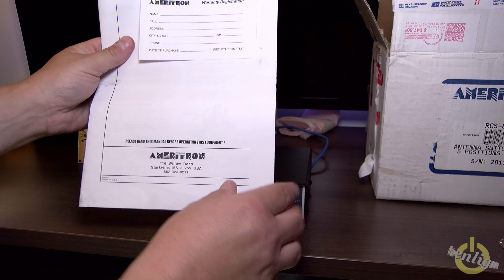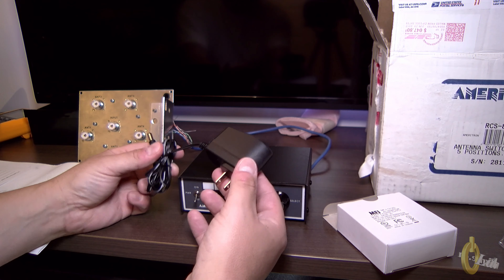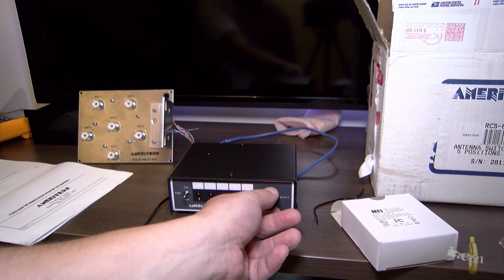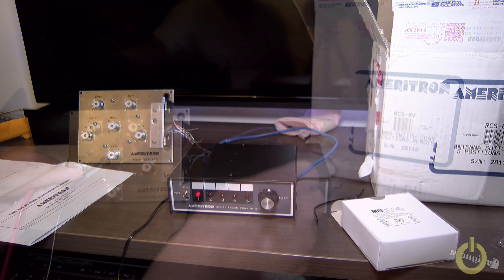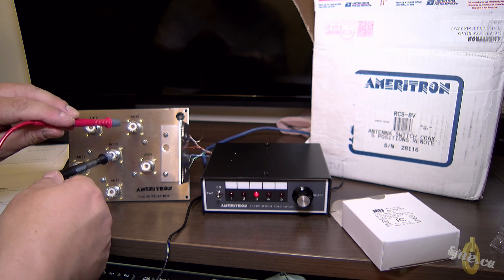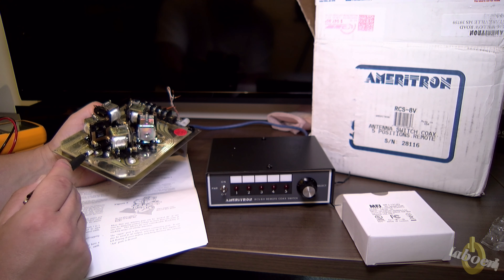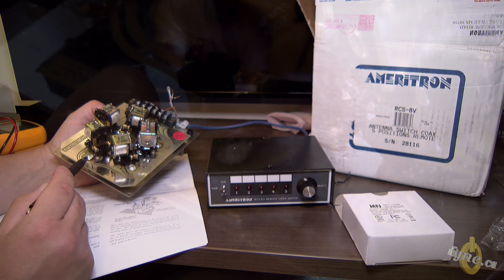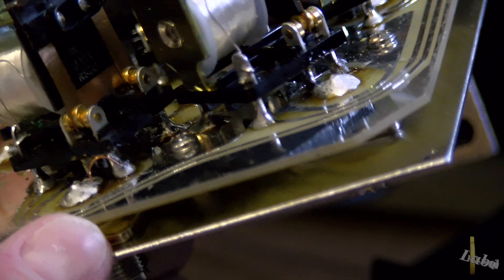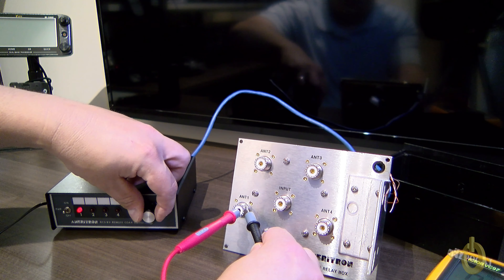It comes with the manual, the warranty card, and it also includes a little 13.8 volt power pack, or you can use your DC power supply if you want. When you turn it on, you can hear the relay because it is close to you — it's not outside yet. I tested all the positions to make sure the contacts were okay — everything was fine — just before you start installing something. That's all five ports. If you want to have the antenna grounded when not in use — normally it's open when you get it — there is a diagram showing the jumper that I installed. You just follow the diagram in the manual, and then when you're not on that active antenna, it is grounded.